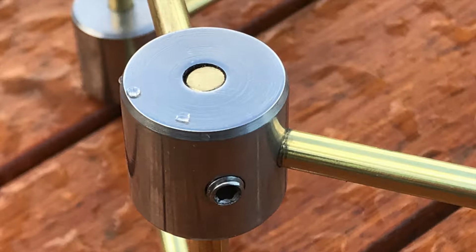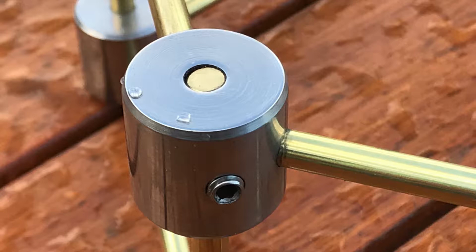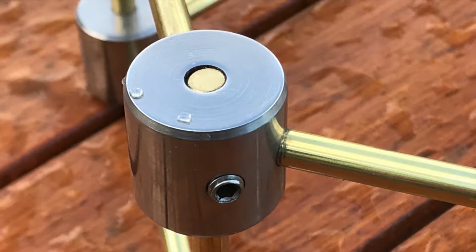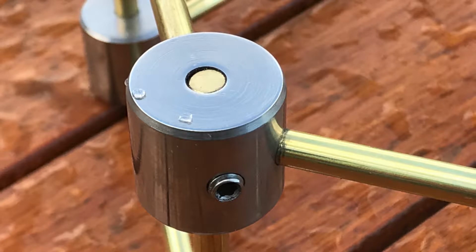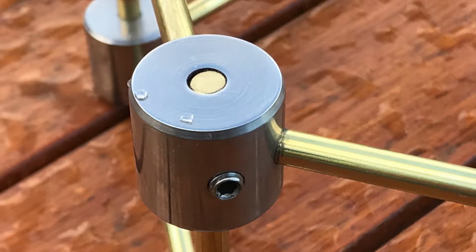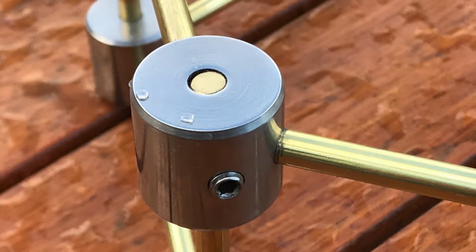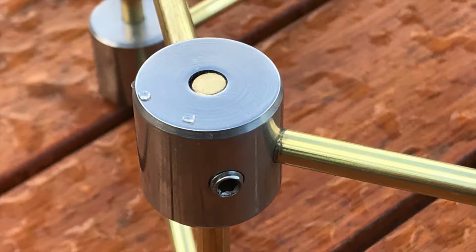After the nodes were finished, I polished them first with about 1200 grit wet and dry emery paper, and then polished them quite aggressively with a cloth buff about 6 inches round on my electric drill. I actually had some special stainless steel polishing buffing compound to use, and that came up very nicely, although you can still see a few marks from the chuck.